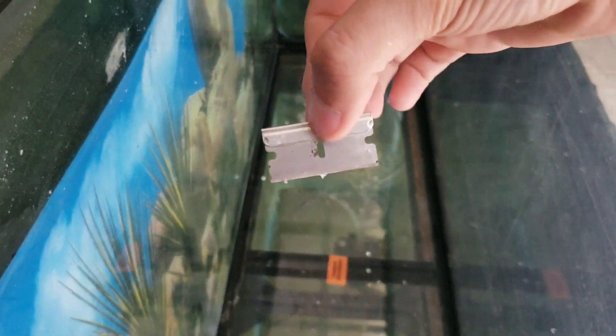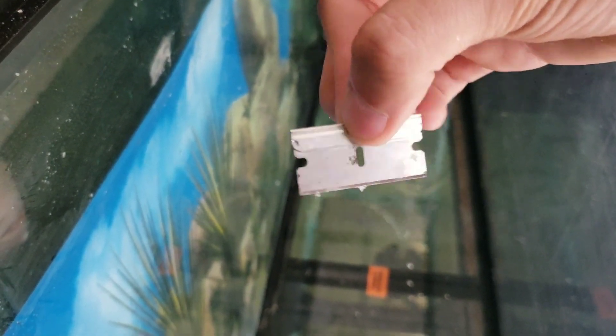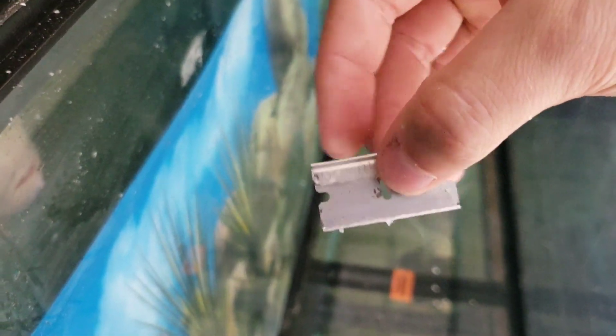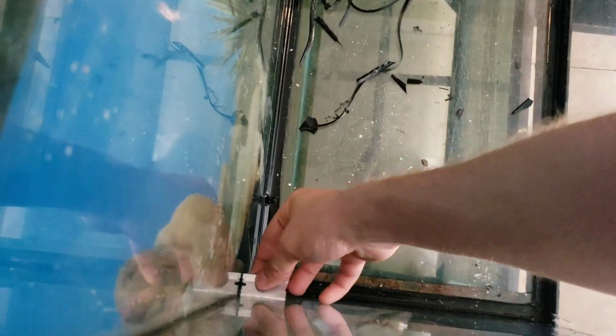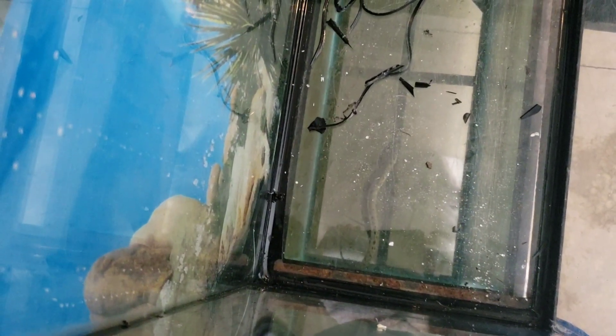One other thing I want to share: you can get a couple different styles of razor blades. I usually get these from Home Depot, a pack of about 30 for just a couple bucks. It has an extra guard on top so you don't cut your fingers, and it's also squared off. Once you get some silicone cleared out, you can stick it against your back piece of glass when you're worried about poking in the seam, and just ride it all the way up the edge of the glass for a nice square cut.